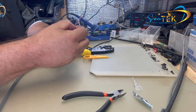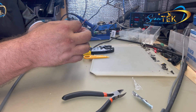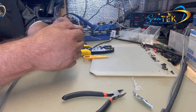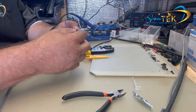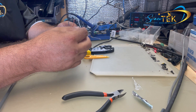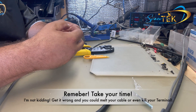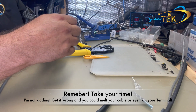Now we're going to be following the B standard — the T568B standard. You can do the A standard for most things, but we like to follow the B standard because Starlink is a product from the United States and they follow the B standard internally. Start off by unwinding all of these wires.